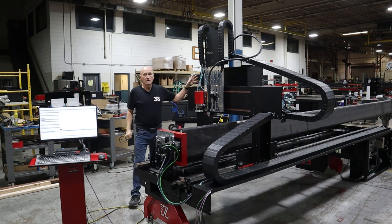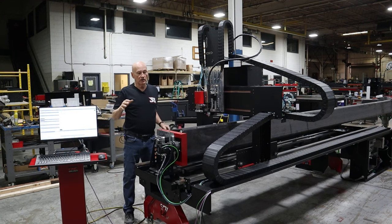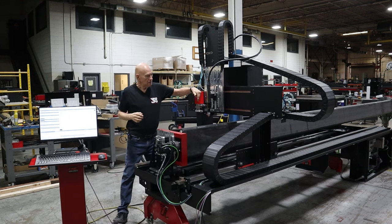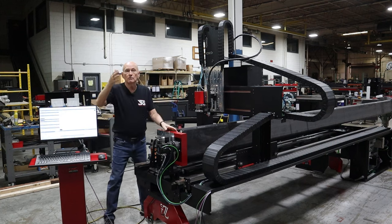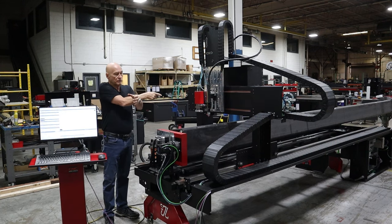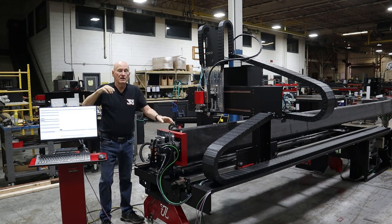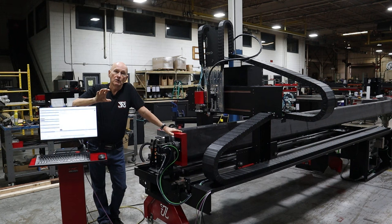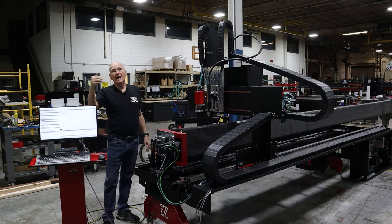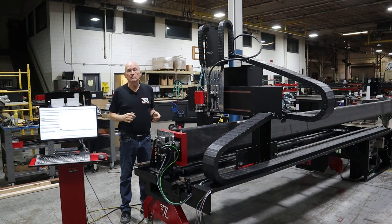On the electronics panel we've added more capability to handle that tap function. In our control system we're adding logic: if we're drilling multiple holes and a slug isn't ejected — because the switch was never triggered — the control system will automatically go through a tap-tap cycle. If the slug still doesn't eject, the machine will fault out and say you need to remove it. And we're building in the ability to restart after that error so you don't have to search through the code to find your position.